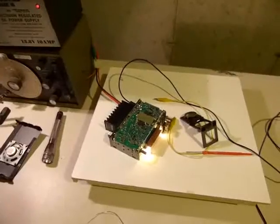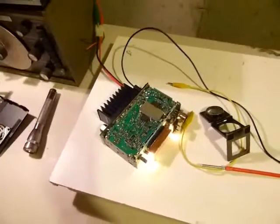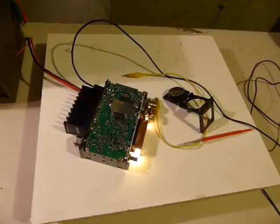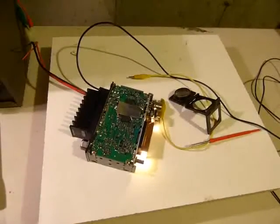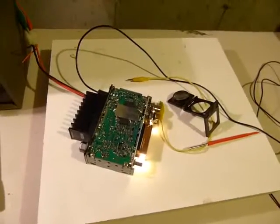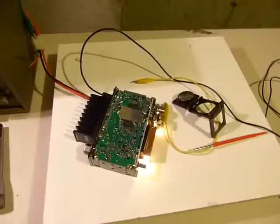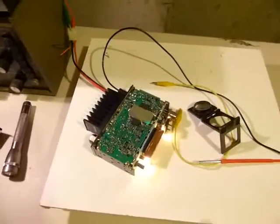I think that's it for tonight — it's getting kind of late. I'll unplug the soldering iron here, and in the morning I might see if I can adjust the deviation control. I think the deviation control on this radio is set a little too high; it needs to be backed down a little bit, at least for this radio's owner. His voice punches through a little hard, and I think it over-modulates this radio a bit. So I'm going to go ahead and do that next.